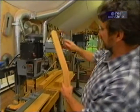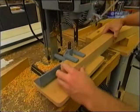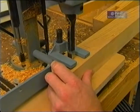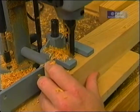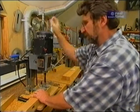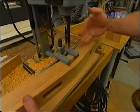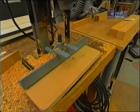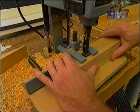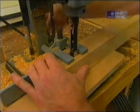The next set of mortises that I need will receive the backrest assembly — I don't need any shims, I don't need any bevels. That completes the upper mortise, but look what happens when I go to complete the lower one. Because of the angle, it pushes away from the fence. So I'm just going to spin the piece around, lower the bit, loosen up the fence, push the fence forward until the chisel just hits the other side of the completed mortise. Lock it in place, and then I can finish the lower one.